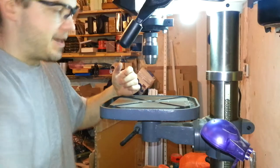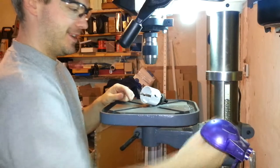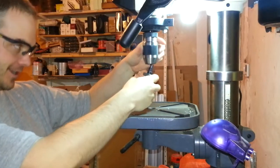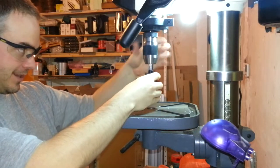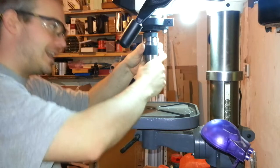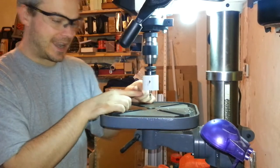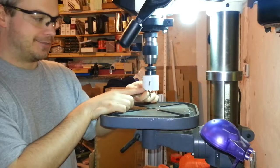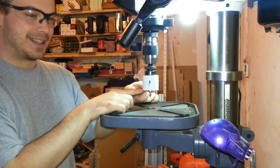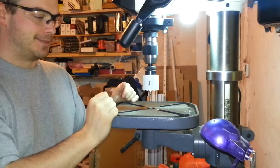Slowed the drill press down from about 1000 RPM to more like 220, I think it was. 1000 RPM on a drill bit this big would be incredibly fast, likely to take your head off as soon as you touch the metal. Now, with a hole saw like this, you definitely need a backing board, definitely need to thoroughly clamp everything down, because you really, really don't want the workpiece getting away from you. A hole saw tends to catch quite a lot. Even drilling wood, you'll find that it will catch and spin the wood, and you would be amazed how much power there is in a drill. Even a little hand drill, practically pull your arm off, let alone something like this, which at this sort of RPM, the torque would be amazing. There's no way you could control the workpiece.